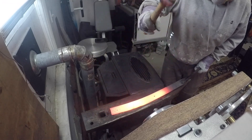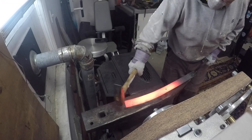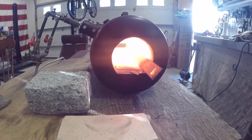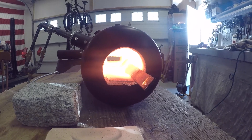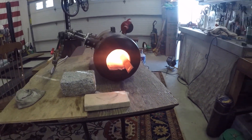That's my annealing process to soften the steel so I can continue working with it later — drill it and shape it before I harden it. So to work with it you will need to anneal it. While I work with it now it's workable, and then I put it in, close my forge, shut it off, close it, and let it sit overnight to anneal.